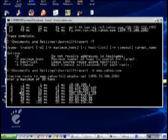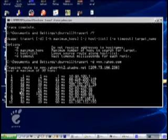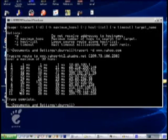Now let's have a look at those times to each particular node along our traceroute. You can see all the times in this particular traceroute are just about the same. Note too how traceroute sends back 3 times to each destination or each hop. That's because just one might not be representative of the link between you and that node. In other words, one might be high while the other 2 is an average representative sample. Highly informational, very useful when troubleshooting network connectivity slowdowns.